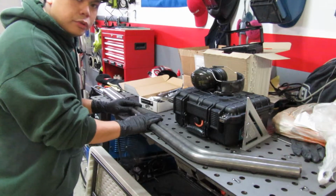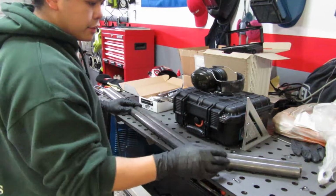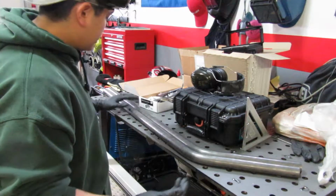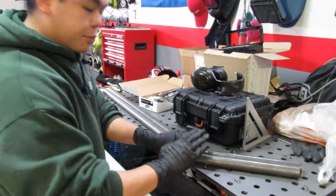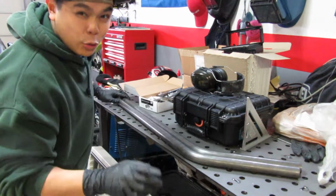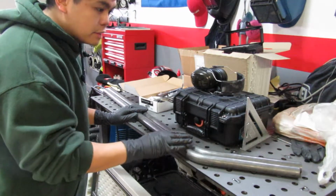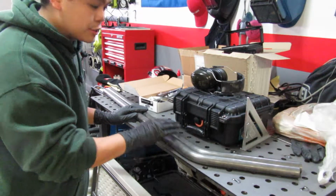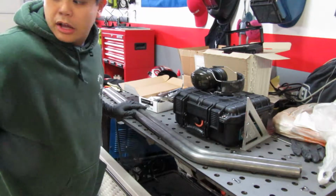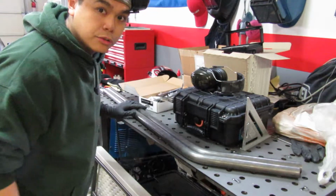We have the two outer pieces, inner pieces actually, of the frame bent. They're very, very close to 45 degrees, but more importantly is symmetry. And if I butt up this curve here and squeeze this end, I get no play. So these two pieces are probably within several hundredths, if not thousandths, of an inch accurate to each other. So very, very symmetrical. I think these pieces actually came out a little bit better than the first two outer pieces that we bent. So very, very good news.